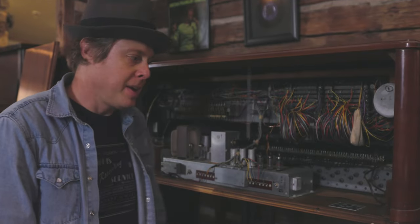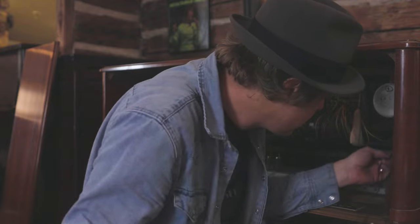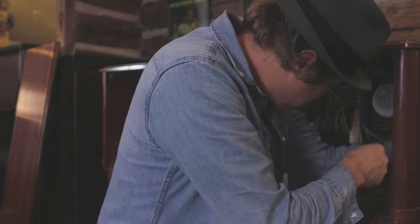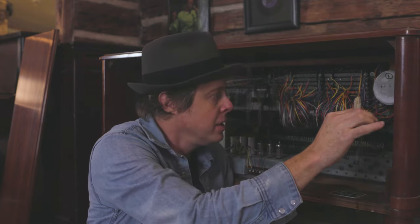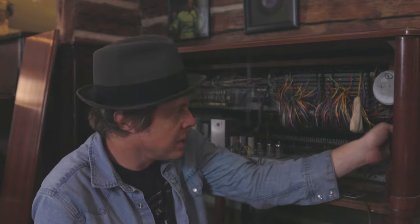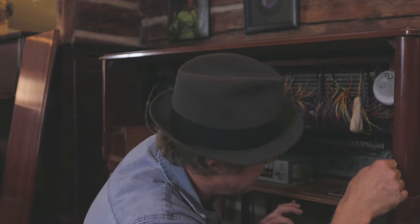I love the smell of a Hammond organ — it's like the Air and Space Museum, like any one of those capsules. I'm taking care to make sure the wire is not touching the start motor and is not actually on this felt where the oil from the tone generator can cause the plastic cable to degrade. I just want to make sure I lift it off of there. I'll probably use a zip tie up in there just to keep it out of the way.